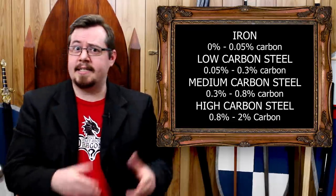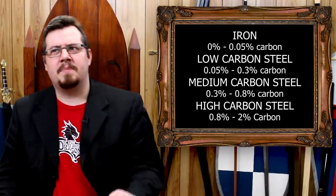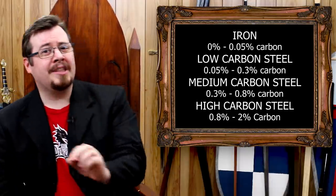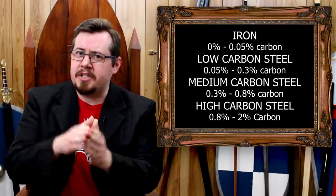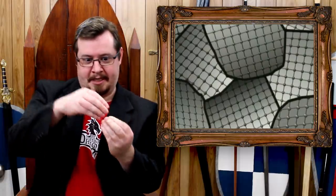It's not just pure iron — there are other trace elements in it, and the most important is carbon. To get steel you need a certain percentage of carbon in the iron. Quenching becomes massively crucial when you have this carbon component, because dependent on the heat in the material will depend on how that carbon will be distributed within the actual atomic structure of the iron.